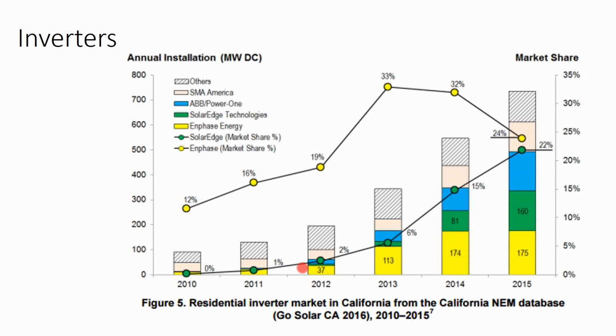So, having a shaded roof until 9 is not the worst thing in the world. Maybe you'd have a tree line that would just climb up your rooftop for 2 weeks around winter solstice. And having the bottom row of modules shaded for 2 weeks on winter solstice is not the worst thing in the world, but if it impacts the entire array, that might be the decision between only having a 4 kilowatt system or an 8 kilowatt system.